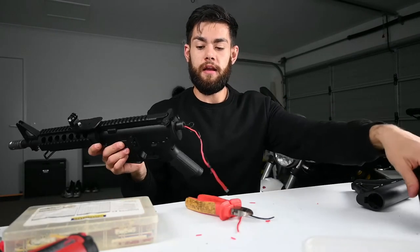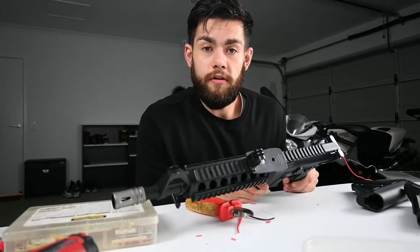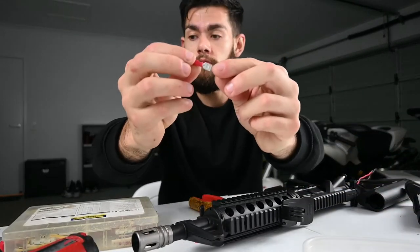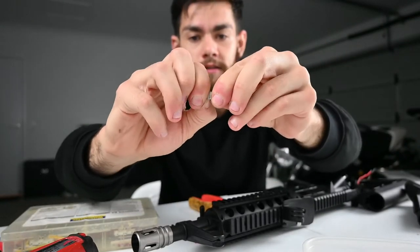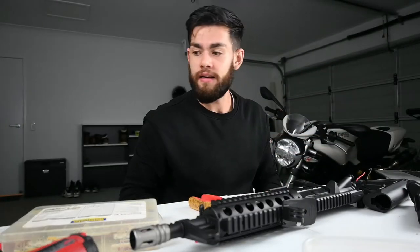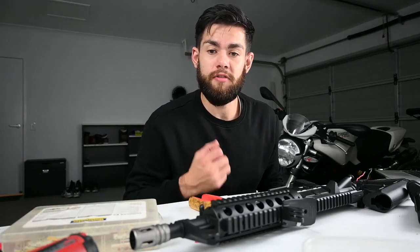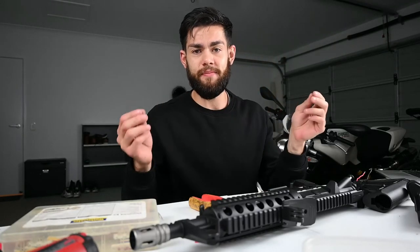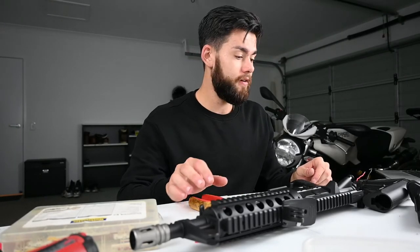And as you can see, I don't even have a plug on this yet to test it. But basically, your motor terminals you can do with lugs as long as you have the room. I got these out earlier. You can use like clip together lugs that just push in. Always use insulated lugs because you just don't want anything shorting together. You can solder it. You can just twist it together and heat shrink it together. Because it's in a sealed little handpiece, the chances of it slipping out or coming loose is very low, but it can happen. I didn't say it can't.